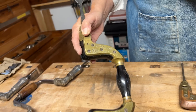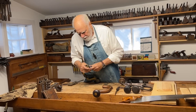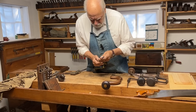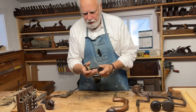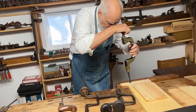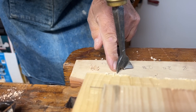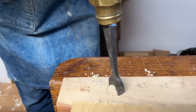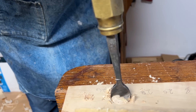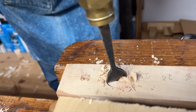These braces differ from earlier ones where the bit was held by a screw — they have a sliding end: push it, slot the bit in, and release to hold it. This is a special kind of bit called a center bit. The sharp edge first delineates the outside of the hole, guaranteeing a nice sharp edge, and then the inside cuts the wood away until we get a nice straight-sided hole of whatever depth we want.